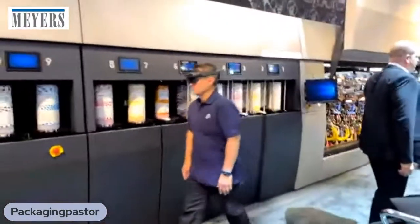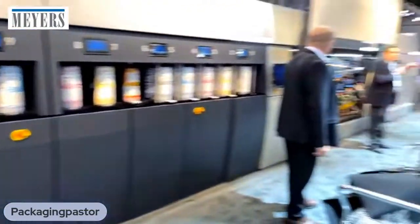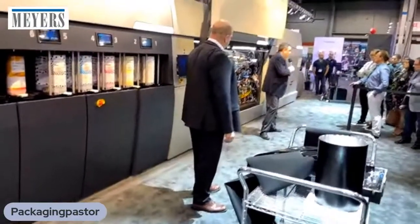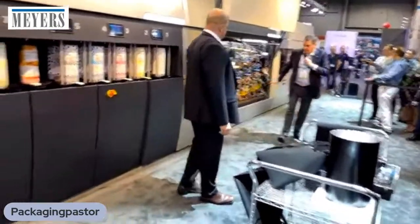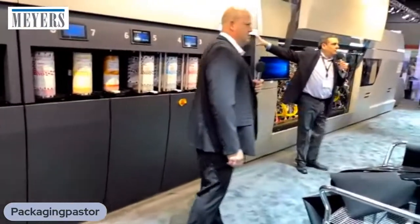So after the inline priming unit, there's a buffer, then it comes here, and this is actually where the AR augmented reality headset that they send out is used, if you need to do the web heads underneath the imaging remote cabinet support, which we've already discussed, and under the ink cabinet, which is where we find ourselves now.